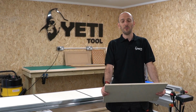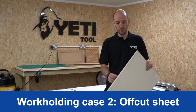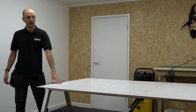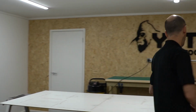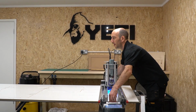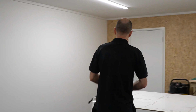In our second example, we'll look at holding onto a smaller offcut. And in this case, again, we'll be using another 12mm piece of plywood. So same spoilboard again. This is our 9mm MDF with melamine faced, tracks on the top, but no high spots, smooth on the bottom. I'm just going to position that, make sure it's in the middle of the bench, over all of my lower beam rollers. That's covered, and now I need to align, make sure that it's parallel to the bench.